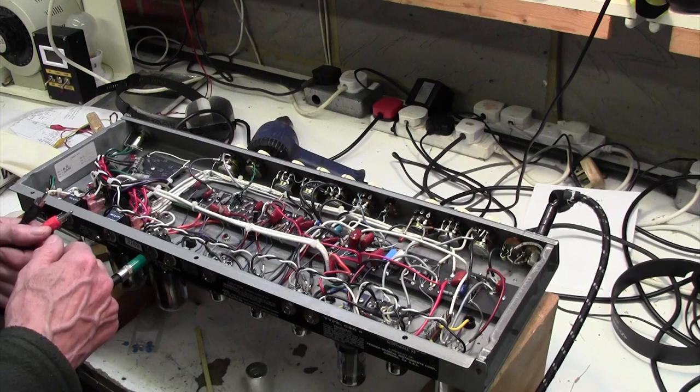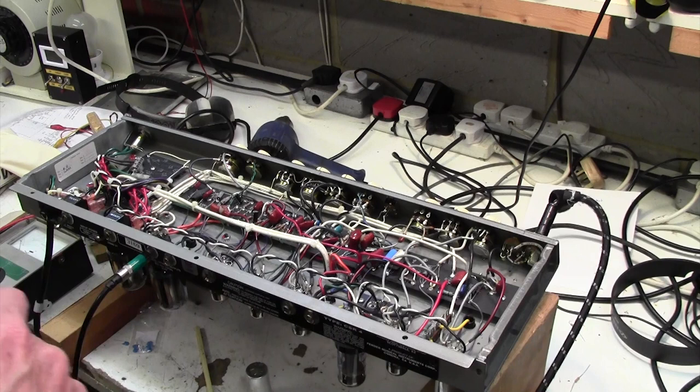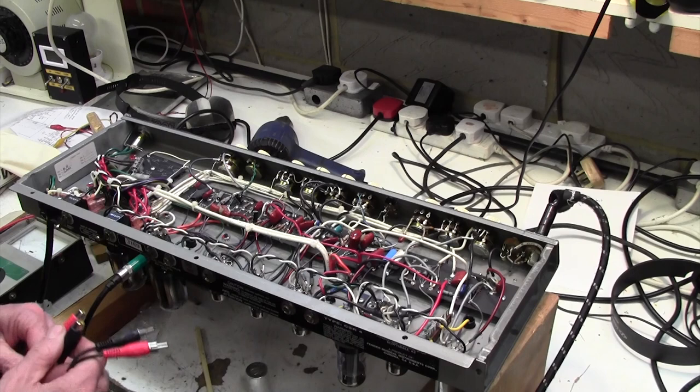I tried putting it from that side to ground and it did reduce the tick 50%, but also killed all the high frequencies on the amp, so that's no good. So at the moment we have no fix on this well-known problem of vibrato ticking on Fenders like this. So I've asked the client what he wants to do and I'm waiting to hear from him.